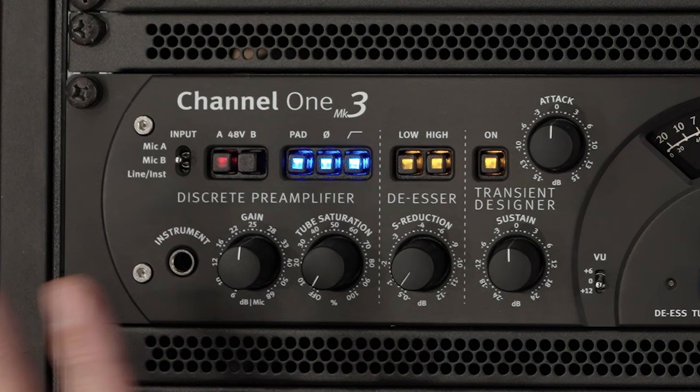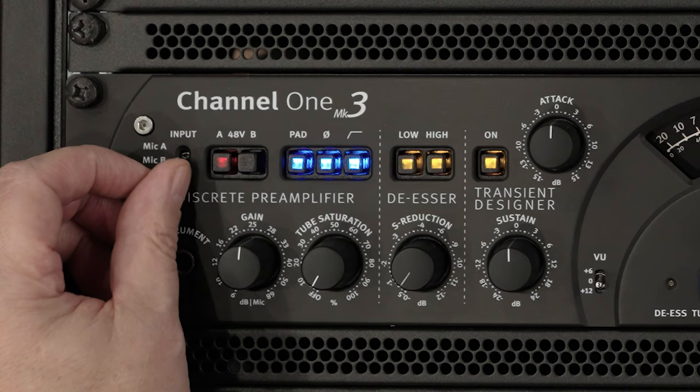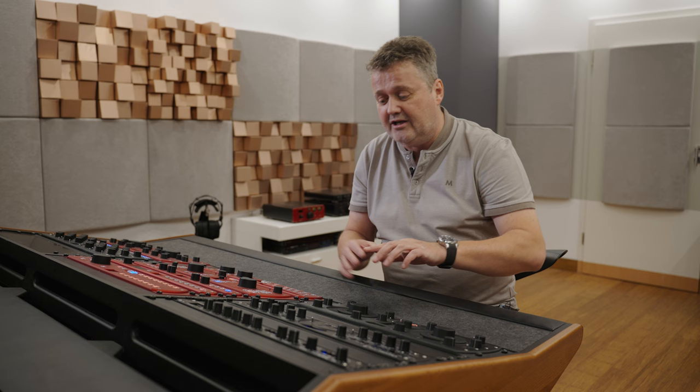When you make a selection like this, you need to protect the microphone. In the event of switching from microphone B to A or vice versa, you can hear a relay click in the background. We switch off the phantom power, then switch over to the other microphone, and if the other one needs phantom power, it is put onto the feeds after it's been switched. So that protects the microphone and you don't have any audible clicks while you select — there's just a moment of silence in between.